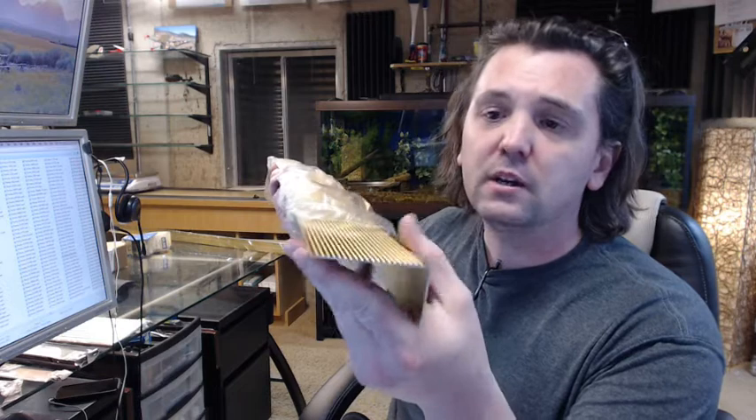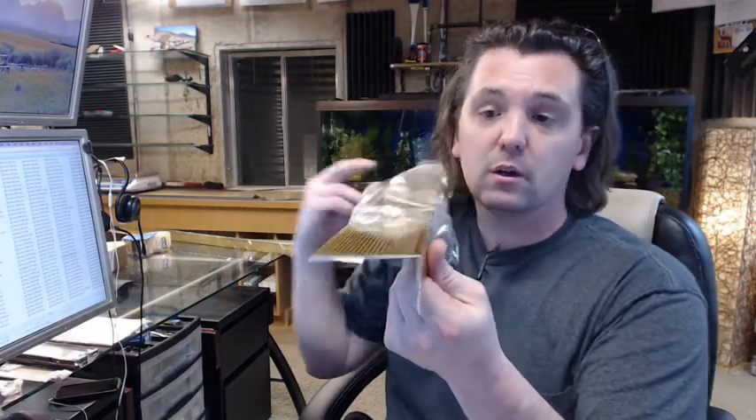This material is quite thin, so if you were going to cut this on a miter box saw you definitely want to put some sort of a stabilizing piece — like maybe a 2x4 — underneath it and cut through the entire material.